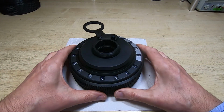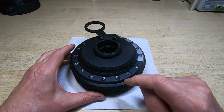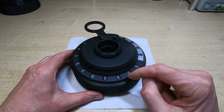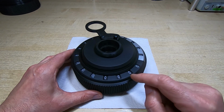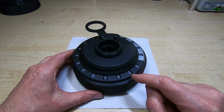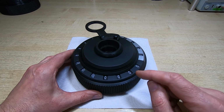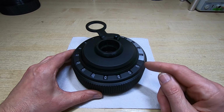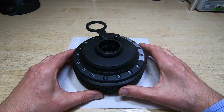So that's the carriage assembled. Luckily the numbers do now line up. I moved them very slightly, about 5 degrees further round to the right. So it turns out, I meant to show you this before I fitted them, it looks like the correct location for the number strip is to have digit 6 centrally aligned with the pin or the pinhole, and once you put it in that location and then wrap it around, all the other numbers seem to be in the right place.